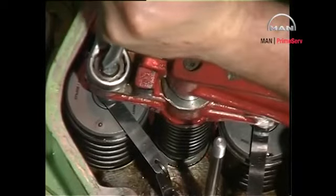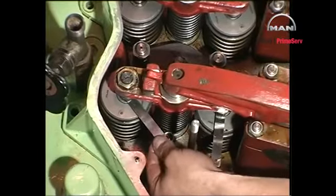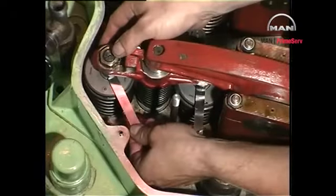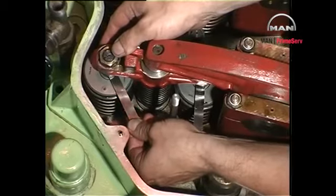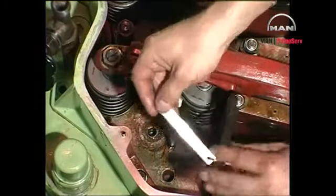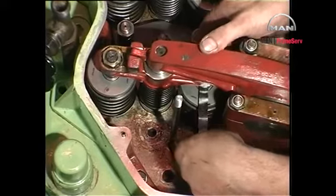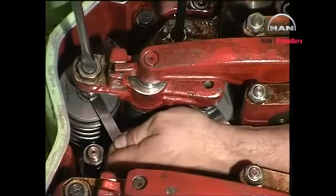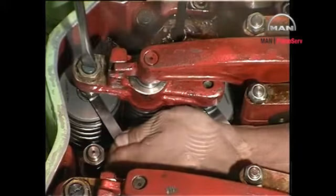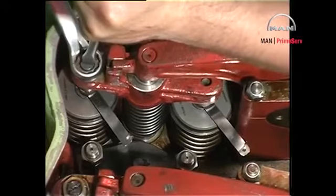Tighten the adjustment screw until the correct clearance has been obtained and tighten the lock nut. Check simultaneously that the clearance is correct at both valve spindles. Finally, make sure that the 0.5 mm feeler gauges marked incorrect cannot be inserted between the spindles and bridge. Repeat the procedure for the exhaust valve spindles, this time using the 0.9 mm feeler gauges marked correct and the 1.0 mm feeler gauges marked incorrect.